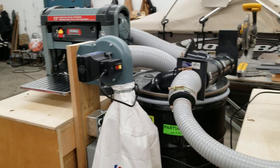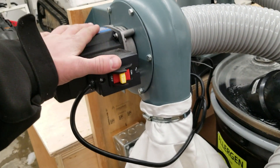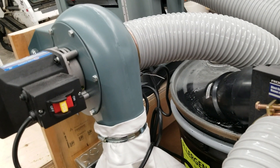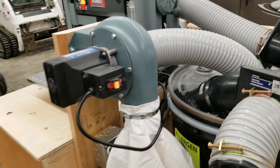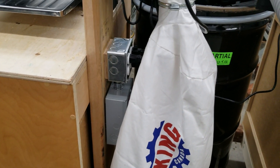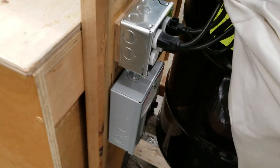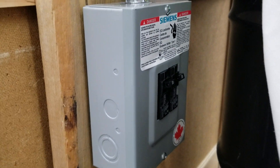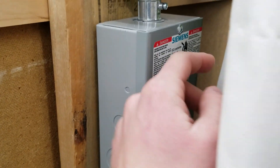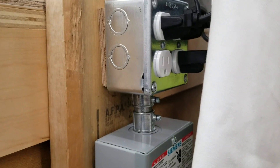The system works really well, which I guess is more what this video is about. I'm just running the King mini dust collector, which is 110 volts, 590 CFM — a little less than the other model which is 600 — but with a four-inch line it's plenty for what I'm doing here. It's a single-stage dust collector, runs just under 200 bucks Canadian at my local store, Great West Saw in Saskatoon. I've got 220 power coming in just on an extension cord, split that up into two 110-volt legs.